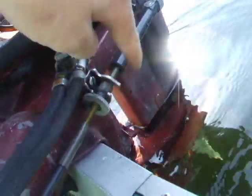These are the new-style control box cables. They say you're supposed to replace the trunnions for these new-style cables, but I found the adjustable ones wouldn't fit in the older trunnions. So I did a bit of a hack job — grabbed the ends of the ears with pliers and slowly pulled them out until it fits. Works fine; maybe not perfect, but it'll do. Do it slowly so they don't break off.